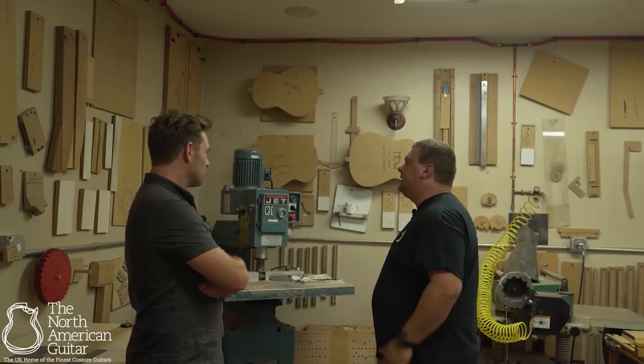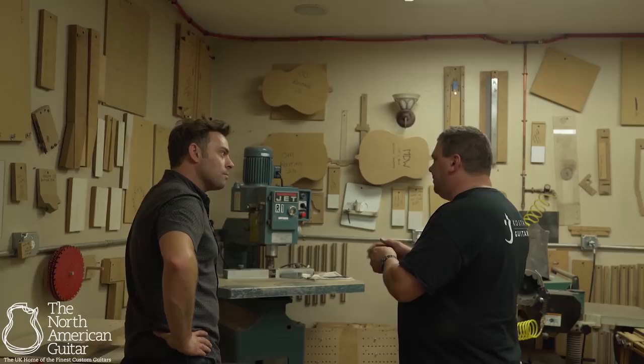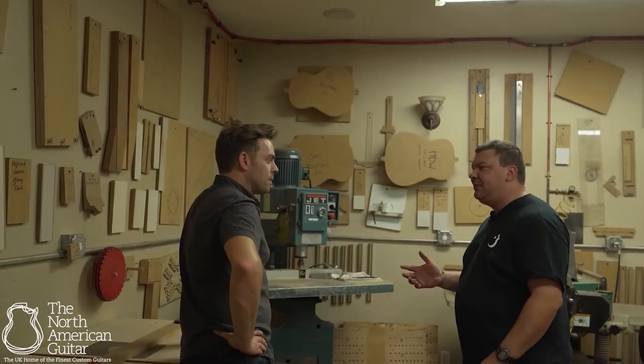You see templates to lay things out, orient the wood, orient braces, and other things to help control a router or drill a hole. It's a fascinating way to build. It also allows me to increase efficiency because I don't have to stop and measure where I want to put the braces every single time. There's a set place I've determined works for me. When you really set up your process, you suddenly save inordinate amounts of time and mental energy.